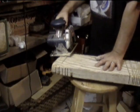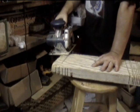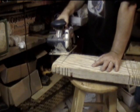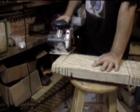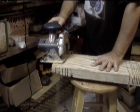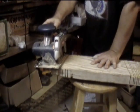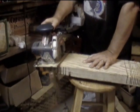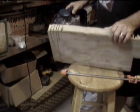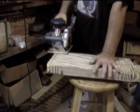If this thing is drawing eight amps during a normal cut — at least this kind of cut — and it's a two amp hour, or in this case roughly two and a half amp hour battery, then it's going to last about 20 minutes because it's pulling three times what it's rated at for an hour. But those peaks when it peaks at over 20 — you saw that on the nickel metal hydride, so you know it's going to do it here too. Those over-20-amp peaks really pull it down.